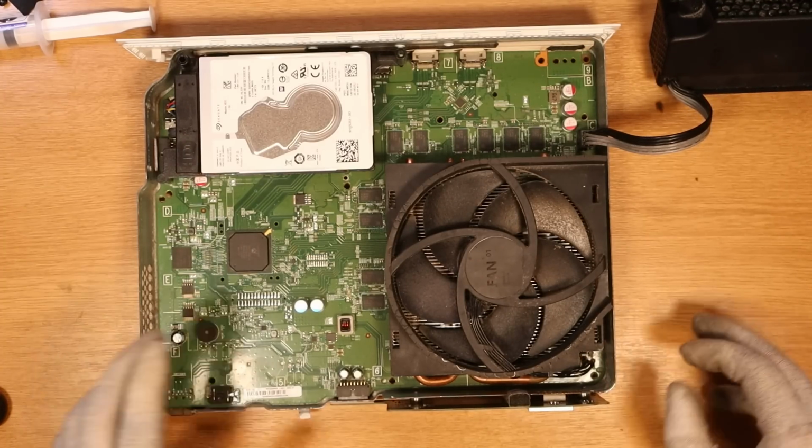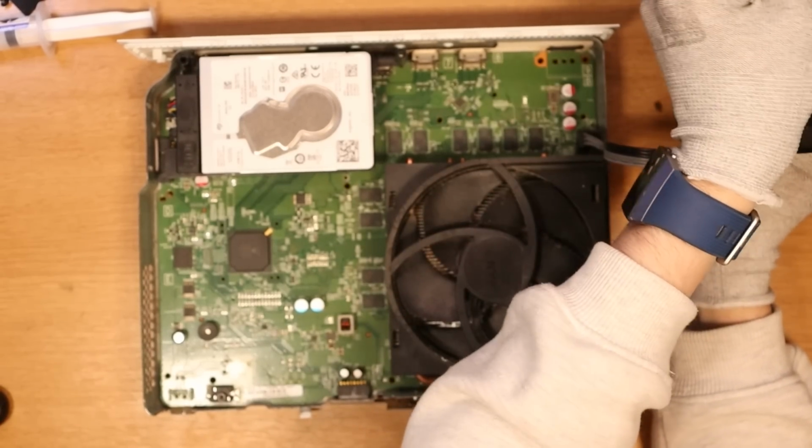No power. I'm not getting anything. Okay. Interesting and kind of, I know it sounds silly, good, because I think that maybe that component, whichever is causing that now to stay off, is probably the root cause. And to be honest, I didn't even check, did I, to see if the short had gone on the 12 volt line by putting that MOSFET back.